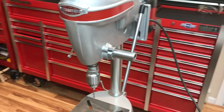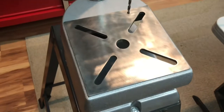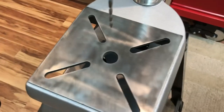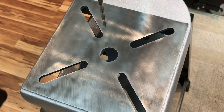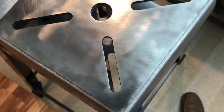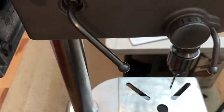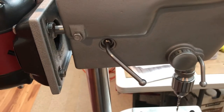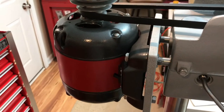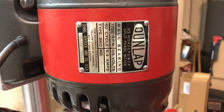That is a hammered gray or silver — really happy with the way everything came out. There was wood on top of the deck that was very rusted, and I soaked it in Evaporust. With just a little compound it came back looking like the original factory finish with the original machine marks — the fact that they had that wood on there protecting it was amazing. All the silver pieces polished out really nicely with the fiber wheel. I put a lot of clear coat on this project — I wanted that automobile finish.